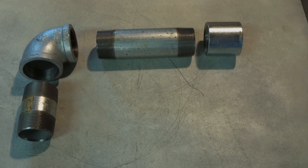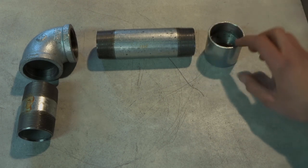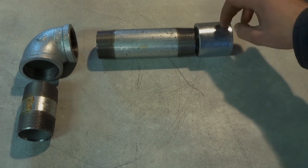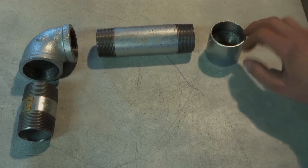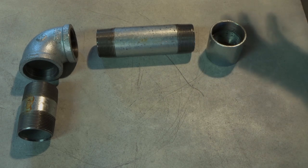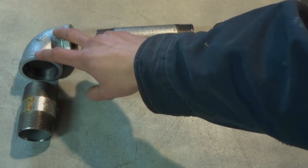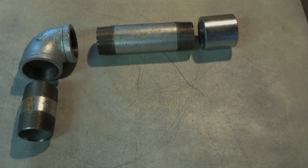This modified merchant coupling is where the blower assembly fits in and has set screws to hold it. If you don't have access to a lathe to do this part, you can weld threads onto the 90-degree of the blower assembly, or you can build the entire transfer and blower assembly out of screw-together pipe fittings and nipples. There are many options for this — it's not an end-all be-all design.